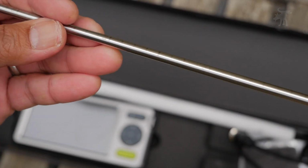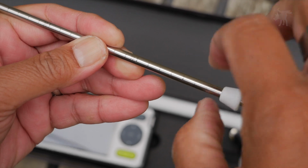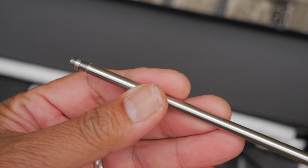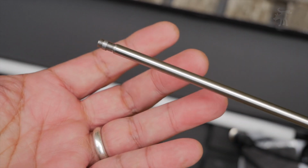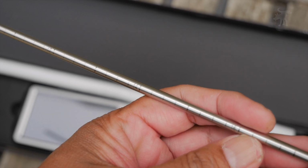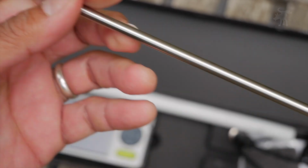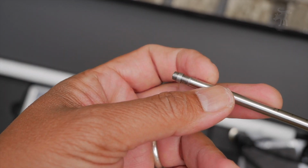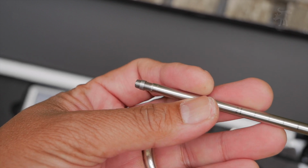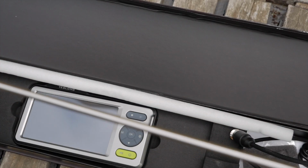as you place it into your rifle or firearm, you just push down this plunger to match up to where your muzzle is, so you can stop it every time. If you find some interesting or problem spot inside of your barrel that you want to take a look at, whether it's a deposit or perhaps some sort of defect, you can determine where it is in your bore. Let's say, as you push it in, it's about 16.25 inches. You just stop it at the muzzle there, and that way you can easily go back to that same spot on your barrel and find your problem spot, or determine whether or not you've cleaned it properly at that one problem spot. But that's super handy to have this sort of physical marking device here.